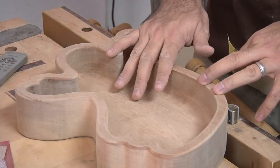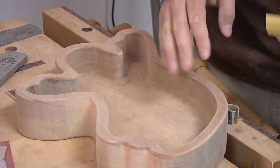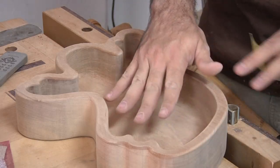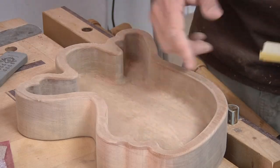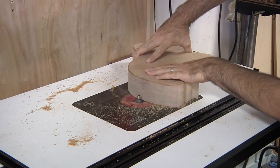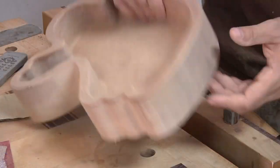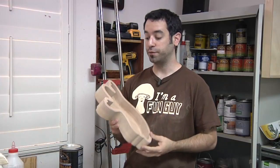With any candy dish or woodworking project, you want to make sure the corners are broken to some extent — just a little sandpaper to ease the edges will stop little hands from getting splinters and cuts. Or you could take it further, as I did, and use a small roundover bit on all the edges — the inside edge, the outside edge, and the bottom edge — for a nice clean, consistent, and soft look. Now let's talk about the finish for our little ghost.